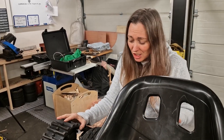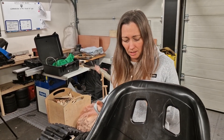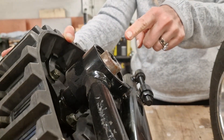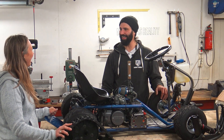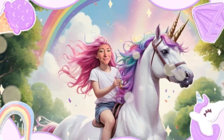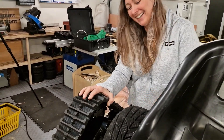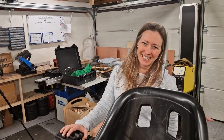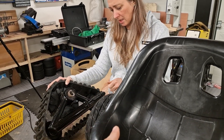So my question is: is it as easy as just putting them on? Well, if you tilt it over a little bit, that splined mount is much bigger than the axle. The hidden problem I haven't told the audience yet is the fact that the splined axle mount on the snow tracks is bigger than the axles on this current go-kart.